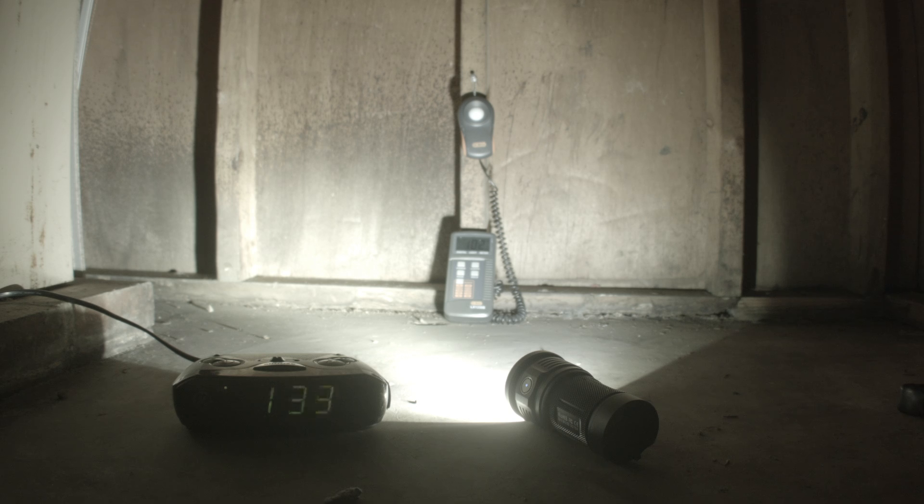Several people on a budget light forum asked why I do time-lapses instead of graphs. Mainly it helps to test the lights on the highest mode when I don't have time to sit and watch the whole time, and it lets me see if there are any weird quirks over the course of the runtimes. Plus it's burning it in for you so you know it works, and it helps you understand I've actually tested the lights. Over the course of 3 hours and 45 minutes it drops from a starting value of 107 on my lux meter to an ending value of 101 — that's only a 5% drop. Awesome.